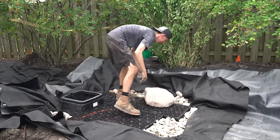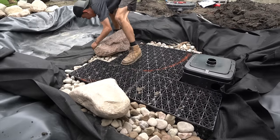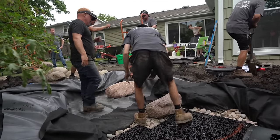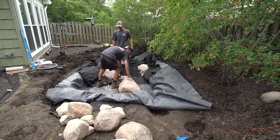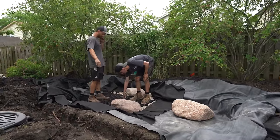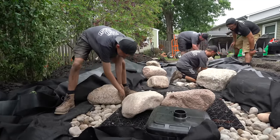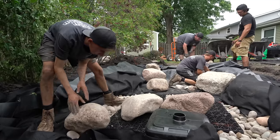Now that our reservoir is totally installed, comes the fun part — the placement of the boulders. Every boulder has a specific place it needs to go. It's really like building a jigsaw puzzle without anyone telling you what the final picture looks like. I start with my big boulders first — these are the key focal point boulders and are used to frame out waterfalls. We also think a lot about how to hide the lid for the pump vault, so a couple big boulders in front of it help hold back some of the gravel too.